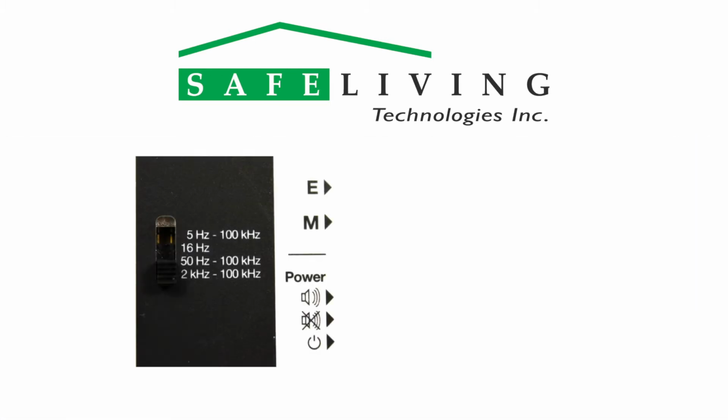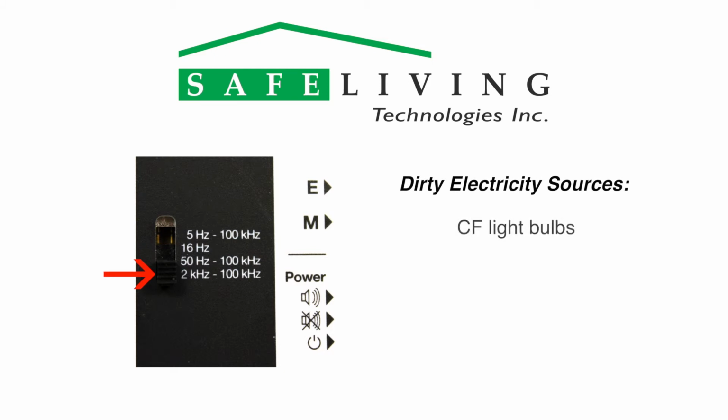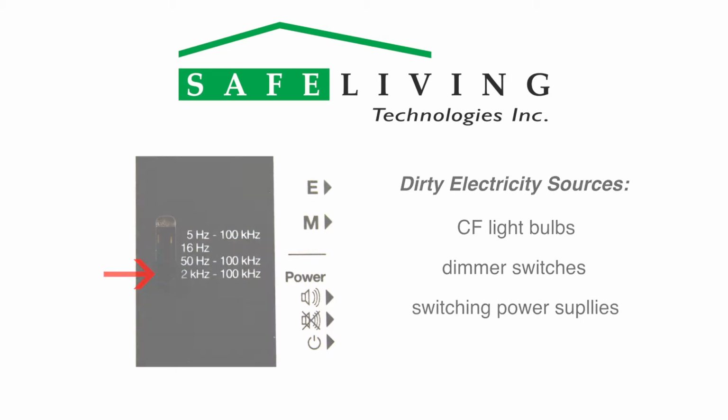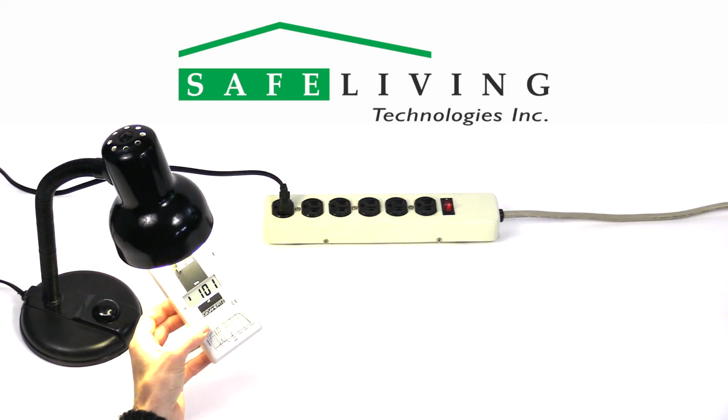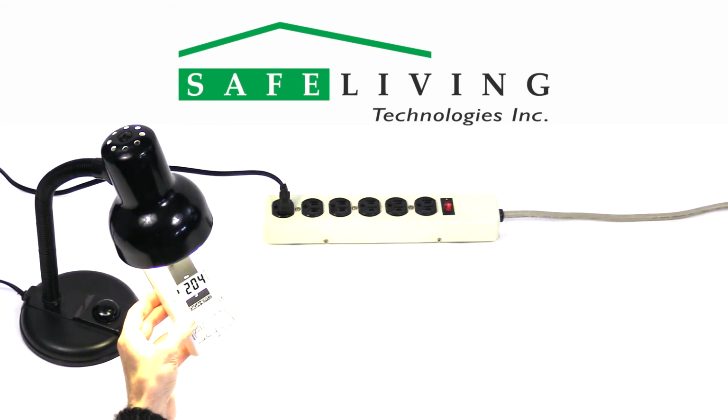If you wish to measure only what's referred to as dirty electricity, switch the meter to its 4th bandwidth range of 2 kHz to 100 kHz. Common sources of dirty electricity are compact fluorescent light bulbs, dimmer switches, and switching power supplies. Here, we see the meter reading these higher frequency electric fields coming from a compact fluorescent light bulb.